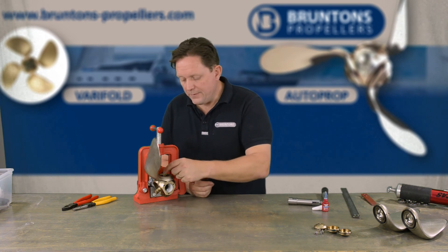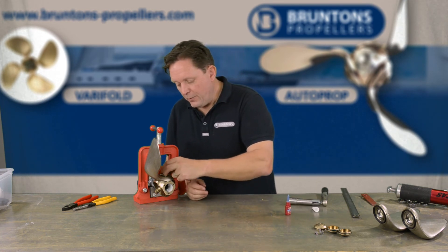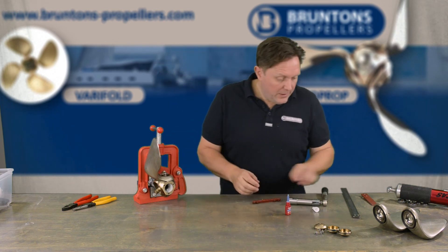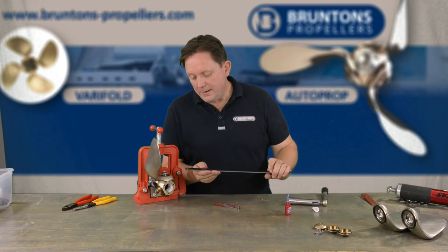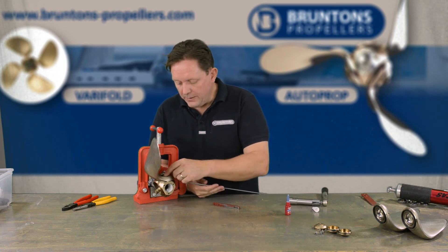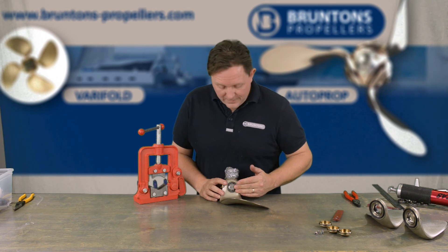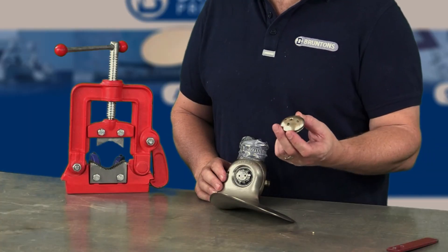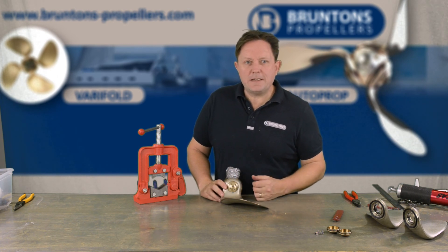Fitting the tab screw is straightforward — it's a left-hand thread, so you unwind to tighten. Apply Loctite to the threads. Bruntons make a tool to fit it; I've made my own for the H5 using a bit of steel with locating pins. Wind it until it locates, then take a centre punch and push one of the fronds in. That's the tab screw fitted, the frond bent down, and the blade is now complete and locked in place. Finally, take the blade cap with its new O-ring and locate it on the blade, tightening to 15 Newton metres for a good seal.